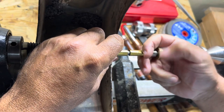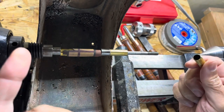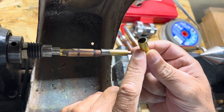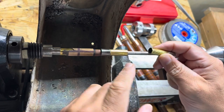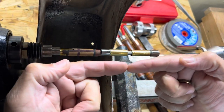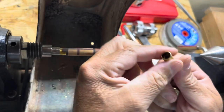That's just one method. Another method is if you have a collet chuck with a collet that will hold the tube, it will cut a lot easier and it won't bind as it's cutting, because there's no pressure holding the two ends together.